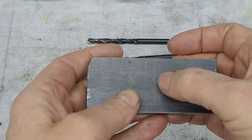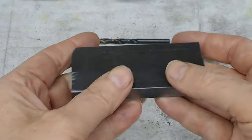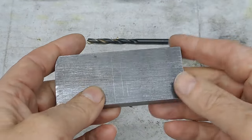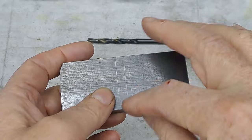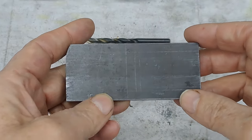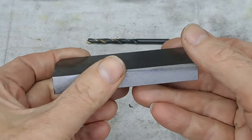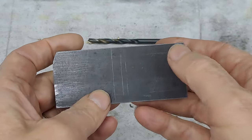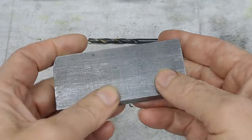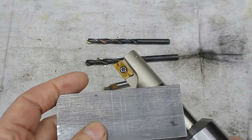That's totally fine because the original drawing called for this to be made out of 12 mil strip of a required length, heated and bent round a former, basically. Well, I'm not going to do that. Don't want to do that. I'm not that good at that kind of thing anyway. This is more my scene: mill it out from solid. I know I'm going to lose a bit of metal, but it gives me a chance to use this tool. It's the first time I'll be using it.